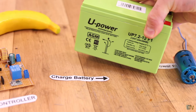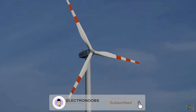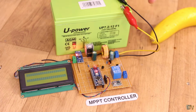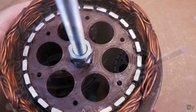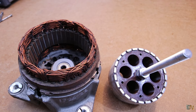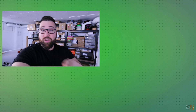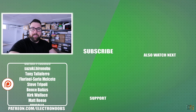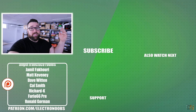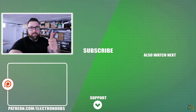By the way, this generator could now function as a powerful brushless motor. I connect it to a powerful ESC, a 12V battery and a radio receiver, and as you can see it acts as a powerful brushless motor — maybe I could use this for an electric cart. If you want to use this as a DC generator, just keep the full bridge rectifier connected and add a big capacitor at the output. That gives you DC voltage that changes according to rotation speed, which would be great connected to a wind turbine or water turbine to supply home appliances.